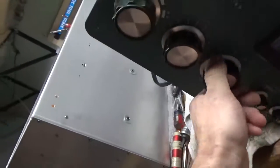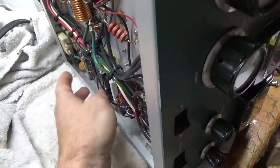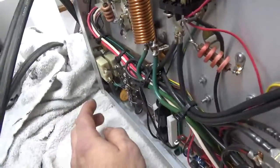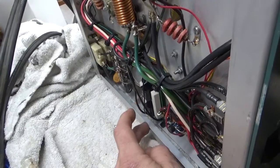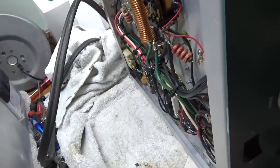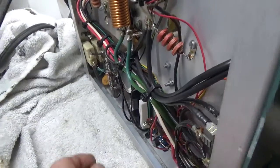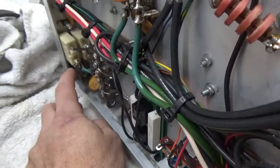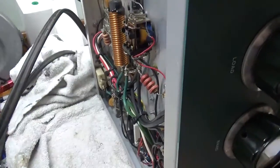This one has 10 meters — someone put 10 meters in it. I'm going to ground the grids, do the bias modification, change the electrolytic cap. I'm going to take the soft start out and clean up all the wiring. A lot of times these fail and it's not needed. What happens is if someone has a short, it takes out one of these resistors. The transformers are wound well so they limit the inrush current, so I'll change those wires and fix all the solder joints.